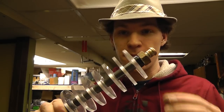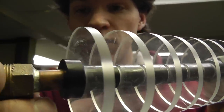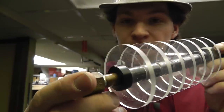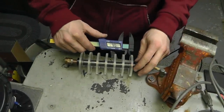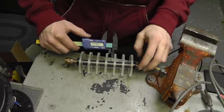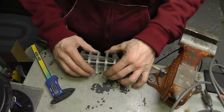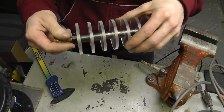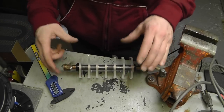There it is — primary. For those of you who have not ever seen this, these are iron cores. I believe that was a 3/8ths iron black pipe and I machined it to exactly the dimensions I would like. Made these plexiglass plates — quarter inch — and that's what I came up with. These are pretty much dead on: .63, .63, .65, .65, .61, .65. A lot of that has to do with the fact that these are kind of sloppy — just barely. They're not compressed on there so tight that they don't move, because otherwise I would have to set this screw into my copper and that would be bad. So the screw is just barely tight, just enough to hold it in place.